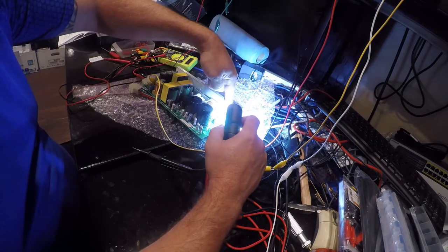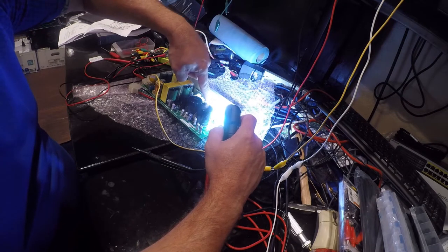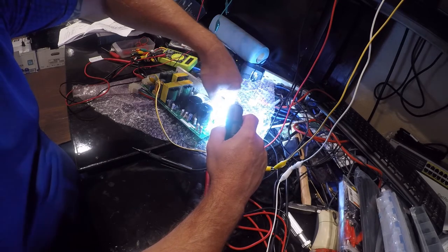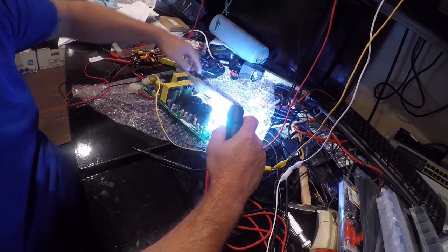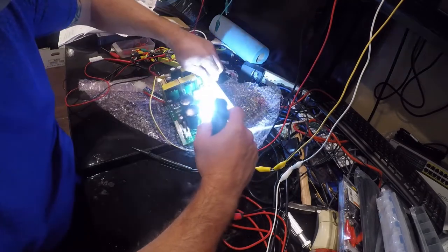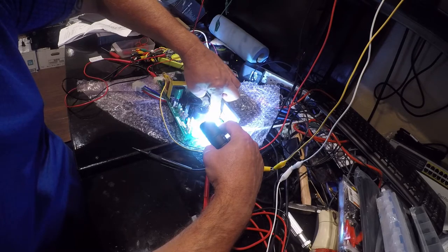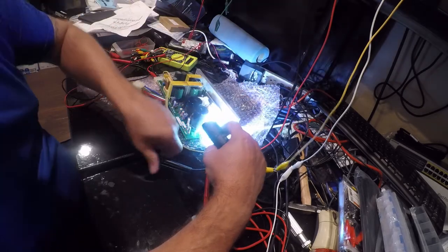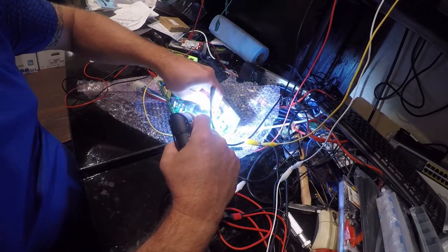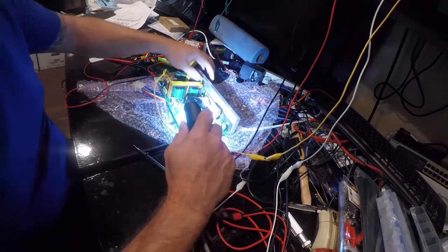So I think this is rectifying to high voltage DC. I got a current transformer here. I don't quite get this. These are varistors, so they're just basically solid state circuit breakers. They'll stop high voltage surges coming in. They did go to the trouble to put shrink wrap on these. I didn't see that, so you have to test these on the ends. If you want to test these, it needs to be down here on the contact. They've even got the vertical parts isolated. I mean, they did a really nice job.